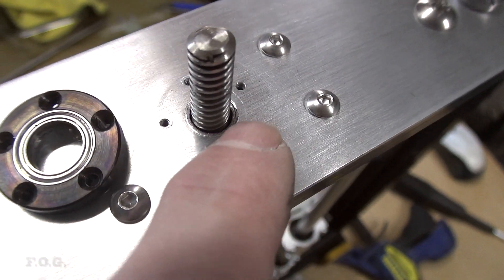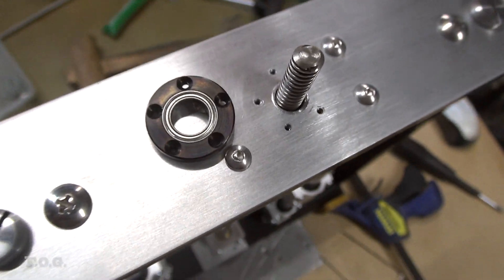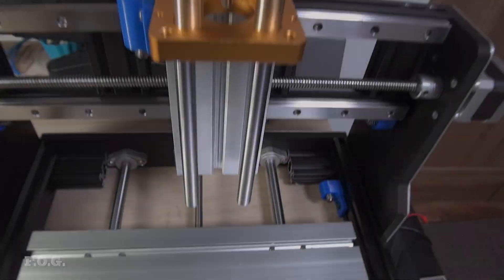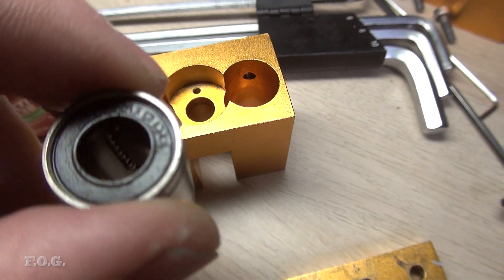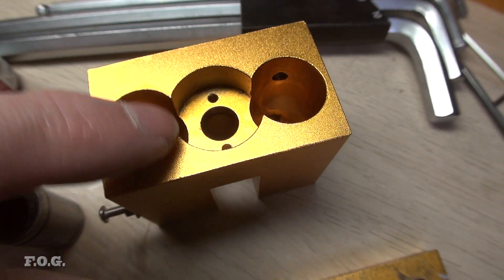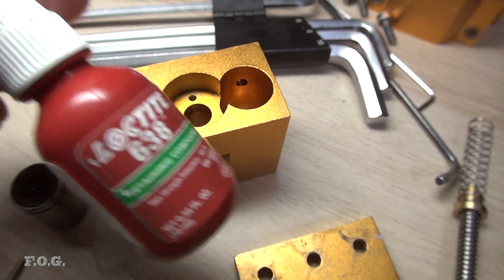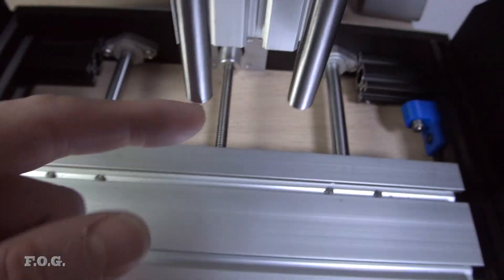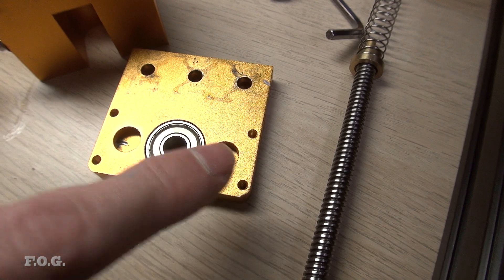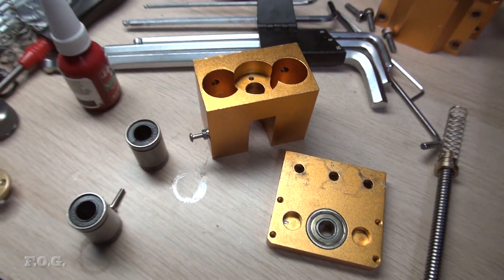Another stupid little mistake I made was not drilling out the front panel lead screw hole enough to provide clearance — easy enough to fix, but I nearly missed it. The biggest worry I had was that there was at first a lot of play in that Z-axis assembly; it was really wiggling around a lot. When I disassembled it I noticed everything was stuck together with green loctite, but as I was assembling and disassembling it a number of times I thought the fit of the bearings and rods would be tight enough, so I decided not to bother putting the green loctite on — which was a big mistake. Thankfully, after reassembling the Z-axis with copious amounts of green loctite, all of the notable play went away, and that was a huge relief.